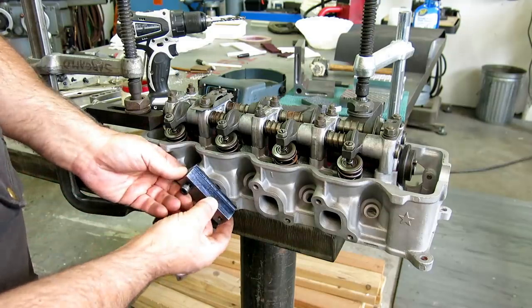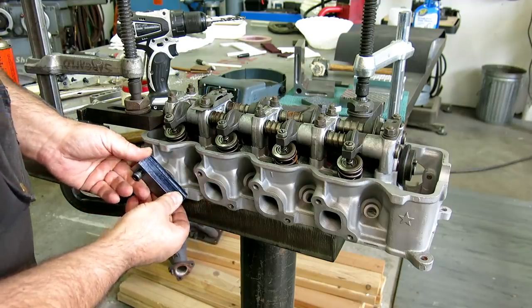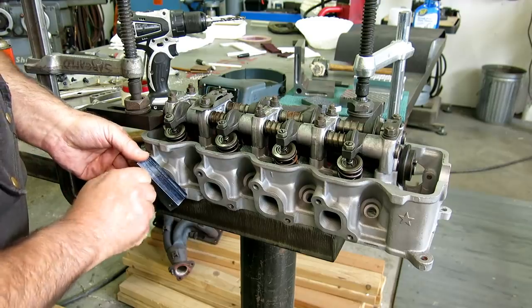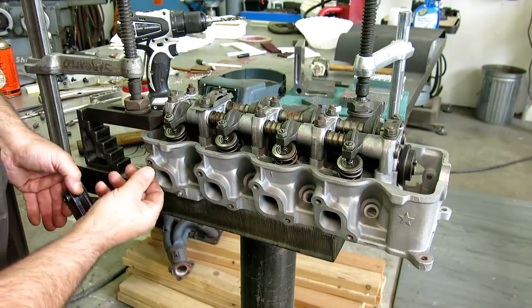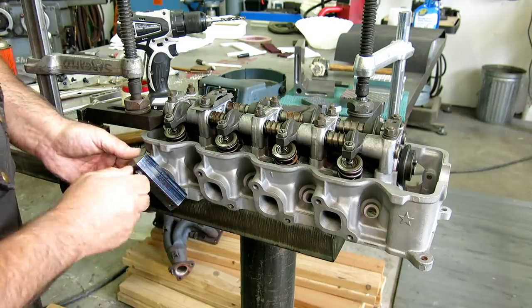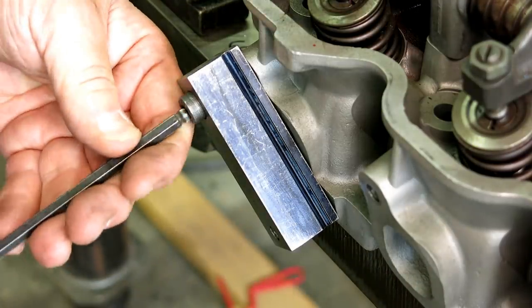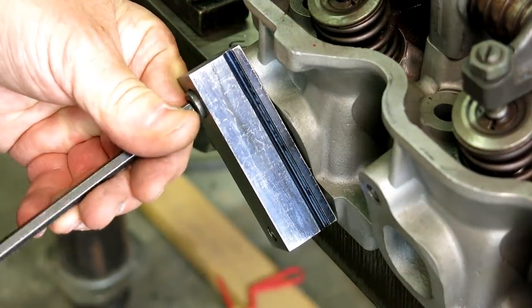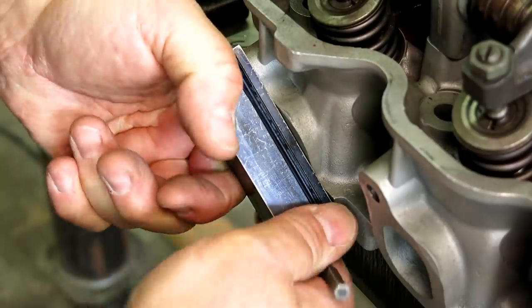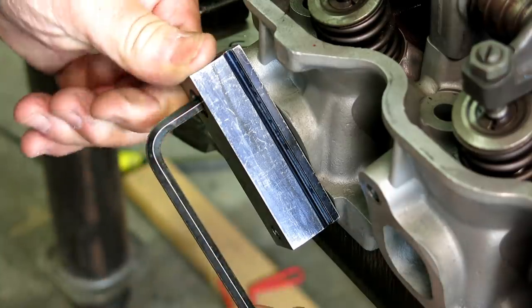So I created a little drill fixture that fits on here and it's counterbored for the bit of stud that was snapping off here. What it does is it helps line that up and then I just pick up this other hole here. Let me get that on there and then I'll bring it in a little closer and we'll drill that sucker up. Let's crank that down. So I measured the center-to-center distance on the studs carefully and then drilled this on the mill so that the centers are good.